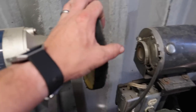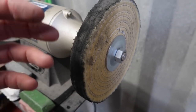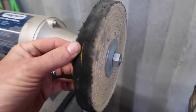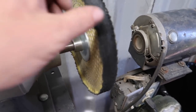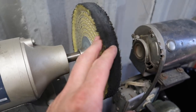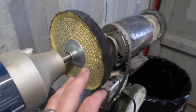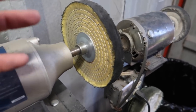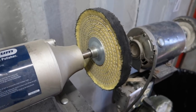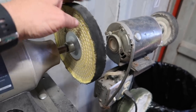So with this wheel here, what I'll use this for is if I go to about 800 grit — if I'm doing a mirror polish on steel — I'll come over here and use a black compound. That black compound with this wheel will actually remove a lot of the surface scratches from the steel. One thing to keep in mind is that when you're polishing with this, I usually keep a bucket of water handy because it does heat up the blade quite a bit. Not to the point that I think it would affect the temper of the knife, but it makes it uncomfortable in your hands — it's really hot. So I always dunk it in water when I'm doing this.